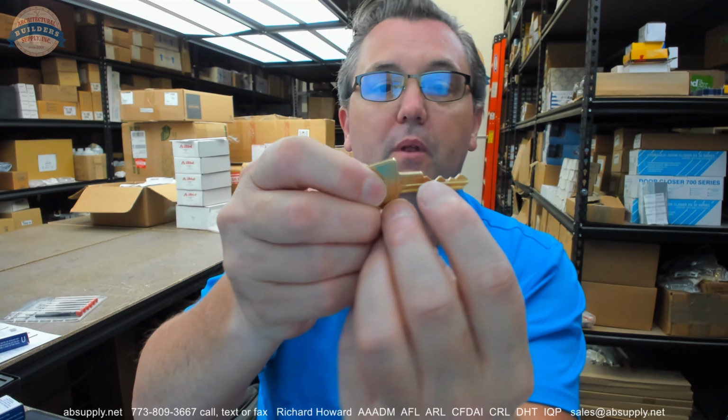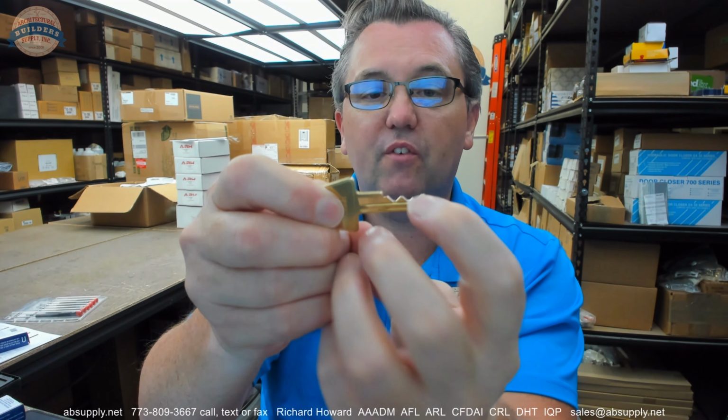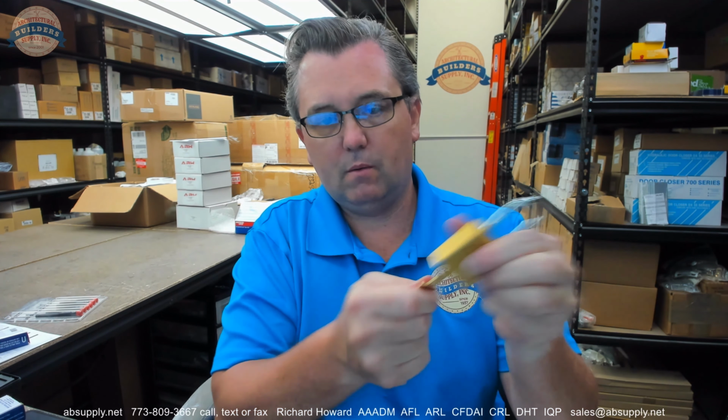so I could measure the root depth of the key, the root depths of each of the 5 cuts, then measure the pins, and then I was able to determine that the smaller root depth, the deeper cut, is the longer pin. And I could do that by eye, but there were 2 depths next to each other that I needed to measure. So we got that put back together, and thankfully that works just splendidly. So servicing it is simple and straightforward.